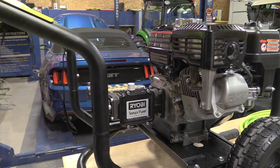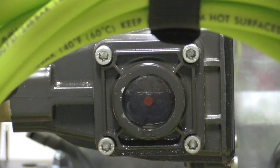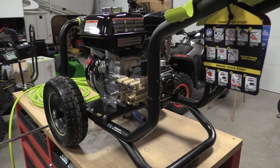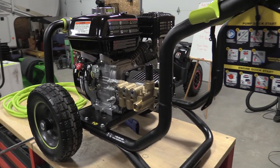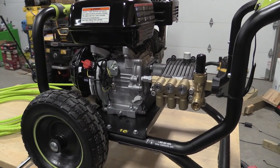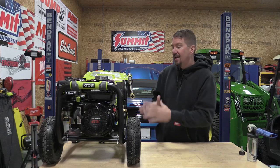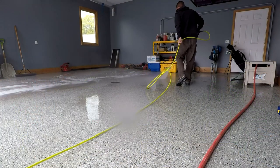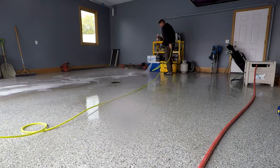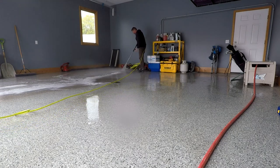The horizontal pump has a sight glass in the back so you can see how much oil is in there. That oil can be changed out in 5 minutes, and it's maintainable, although a lot of people that have these pumps never change oil. Just make sure you have enough oil in there and that it doesn't get contaminated with water during use and you'll be fine. The biggest downside to this unit is the hose — you can see me fighting with it quite often. It is very, very stiff.